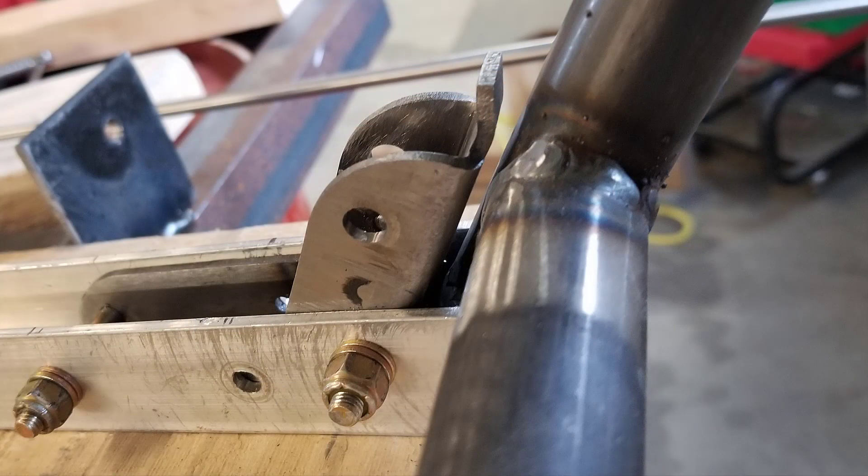This is a photo of the front bracket that the spring is attached to. The measured gap here is 0.103 inches. You can also see the altered attach point of the outboard horizontal bolt, which reduced the length of the bending moment within the bracket structure.